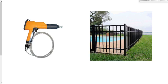So what I do is use this electrostatic painting system. This electrostatic painting system involves taking this nozzle that you see has this tube which would go into a bucket of paint basically. And in this nozzle, we have a rod that's either charged positive or negative. We'll make it negative, although it doesn't really matter. When the paint particles, which, by the way, in this context isn't usually really paint. It's usually like a powder that ends up getting baked on. But we'll call it paint. This paint goes past this negatively charged rod.